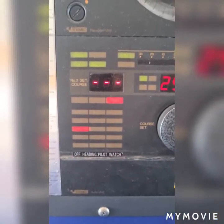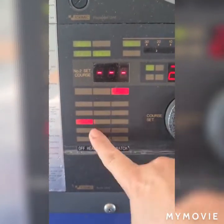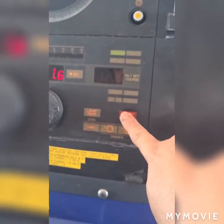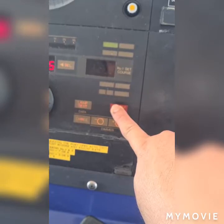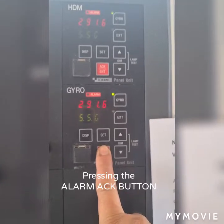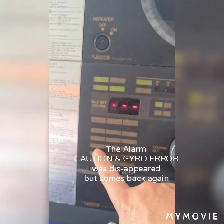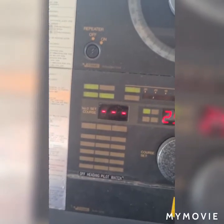I checked the cable inside and found there is a loose connection on the 24 volts DC system. Now the caution and gyro light is on, and I'm going to long-press the alarm acknowledge button here. Once I press it, the blinking light here disappears, and the gyro caution alarm also disappears.